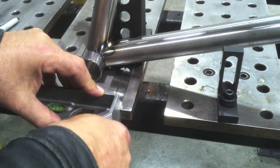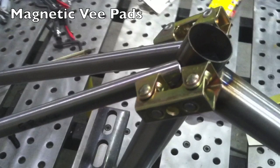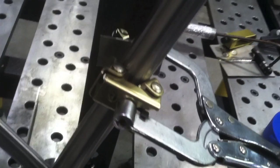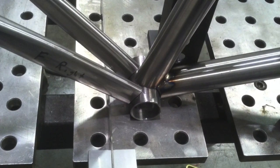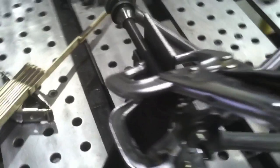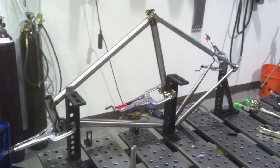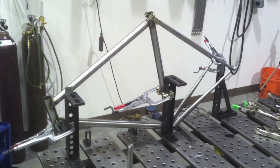There's a hole there where the purge gas goes, so I'm going to get some dimensions and carry them back to the rear part of the bicycle to get everything lined up. I've got a center line carrying backwards and these are some of the Strong Hand Tools magnetic V-pads — really handy for holding small steel tubing or small steel parts that are hard to clamp. The V-pads swivel and hold at pretty much any angle with a magnet. I've got the holes indexed so it's easy to put a square or straight edge against them, line them up with the center line, all true and plumb.